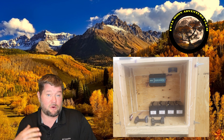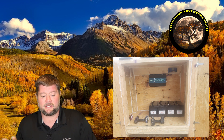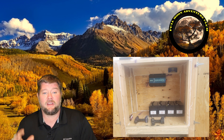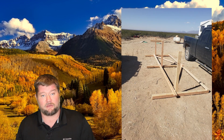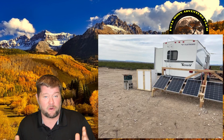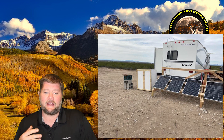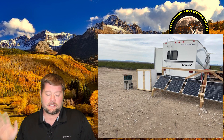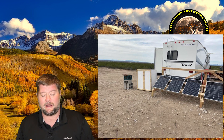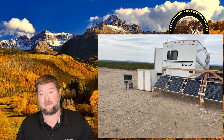We set up the four batteries, chose where to install the inverter on the wall — it's mounted upside down so the plugs face out the left — and installed the solar charge controller, then started wiring everything up. For the solar array, he built a simple two-by-four frame for all the panels to sit on, pointed in a southerly direction at about 45 degrees to give him roughly optimal yearly angle for where he is. He's going to bury the frame posts in the dirt so they don't blow over, since they catch a lot of wind, and make sure they're concreted into the ground or driven really far down.